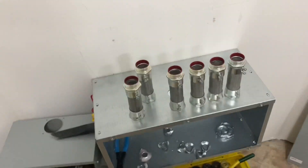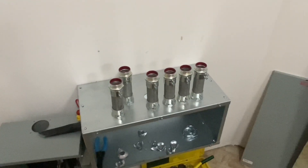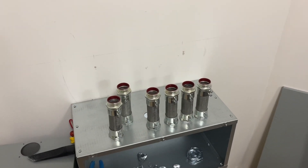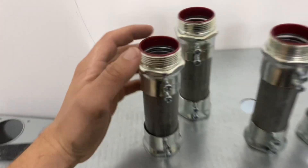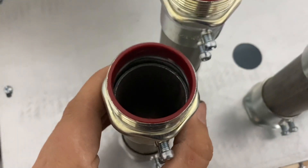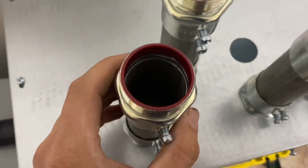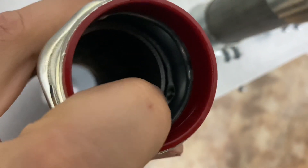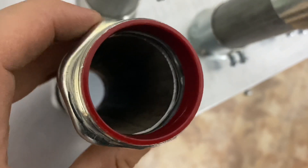This is how you're going to be positioned when you're just about to set the Solark on the wall. If the mounting bracket is too low or off center, that's the worst possible thing that can happen when you're hanging the Solark — so double-check those measurements, guys. All your nipples are reamed and in place but not tight; there's still movement. This is important because you may need to adjust up and down a little bit. As long as both screws are hitting the pipe, you're good — it's nice to have a little bit of play and movement there.